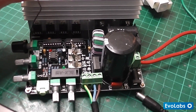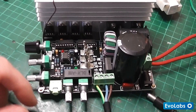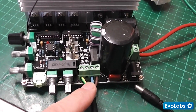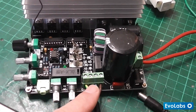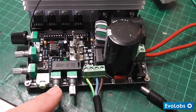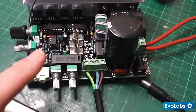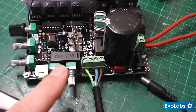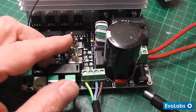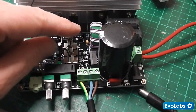For test purposes I just have a Variac and I've been playing with that, but really I want something I can just plug into the mains and not worry about. There is a DC input option and that is where these two pots come into play, via the PWM functionality — we've got the duty cycle and the frequency. To enable that you have to have this switch on, which turns on the PWM functionality, which you basically don't want for your AC input, so I have that off.